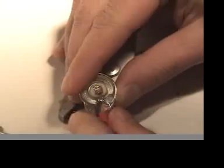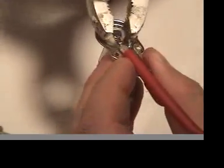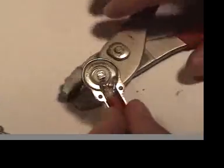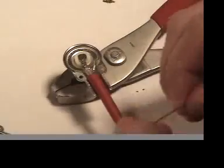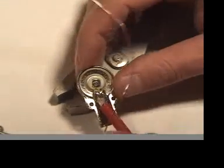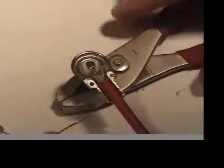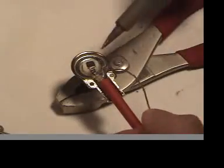Now that I'm done with the tip, you can actually turn the tip connector — I'm going to turn it away slightly. It sounds complicated but it's really not. The main idea is just to make sure the two connections — the shield and the inner core connection — don't touch each other. That's all. Then I'm going to solder the ground.